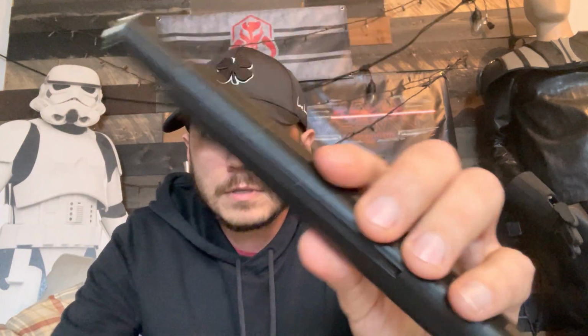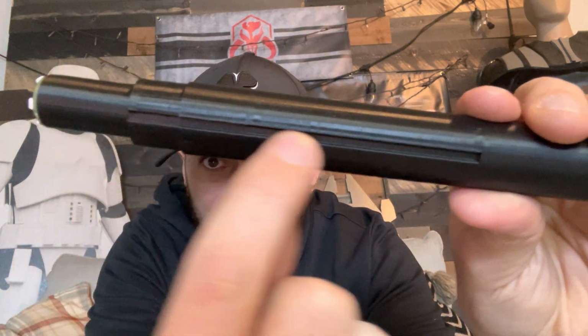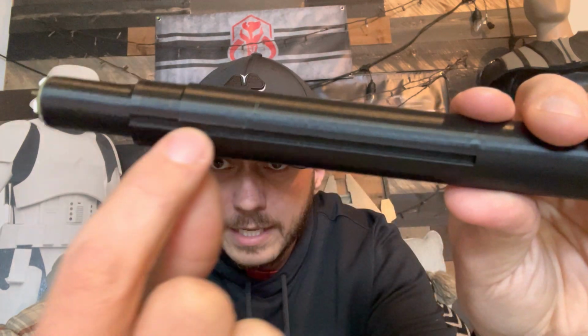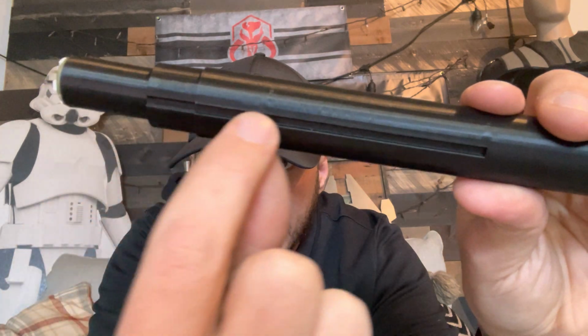So I took these claws off, put that little set screw in there because that is what helps align this chassis. I actually have a groove. I've got a groove right here in the chassis, right? And then it stops right there because that's where I want the chassis to stop. But that set screw rides right in that groove, so it only goes in one way, and then that's how we lock it in place.